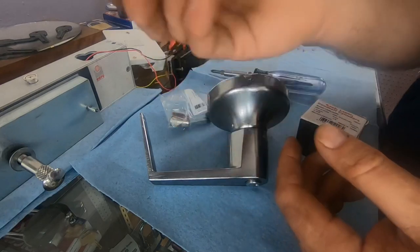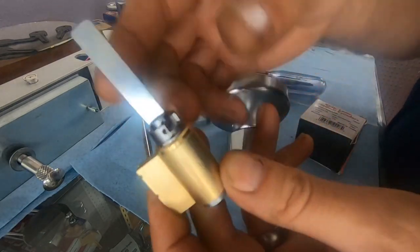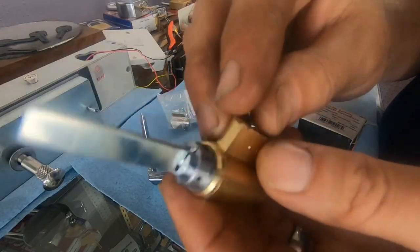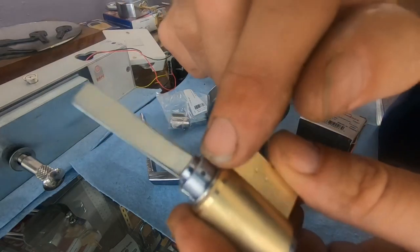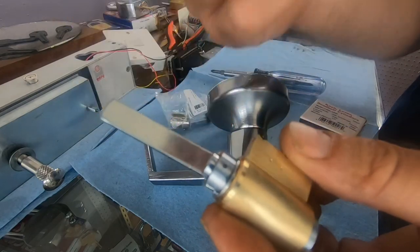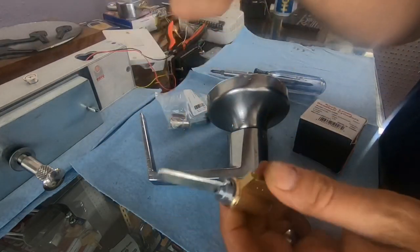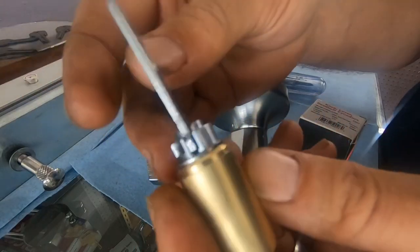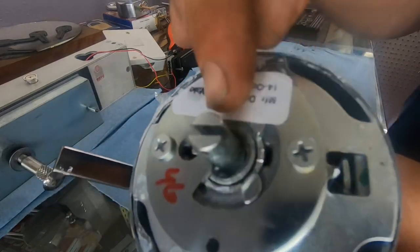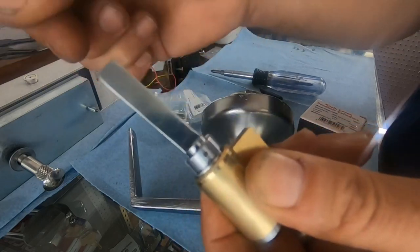As I've taken apart Schlage locks before, you can reach in with a pick and unscrew the cap. However, we see this is a clip style cylinder and a roll pin tailpiece, so we can't get that off. We can't yank it off from the inside like you can some Sargent locks, because that is pretty much permanent. I say pretty much because it's the same style as here and it's missing, but there's no way to get this tailpiece out of the way.